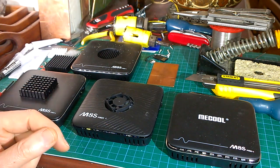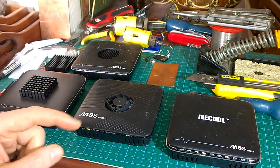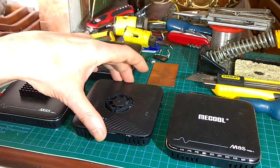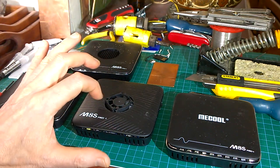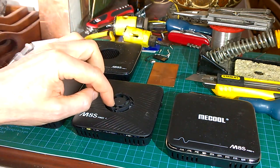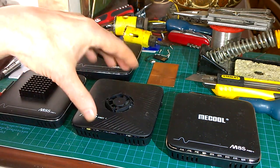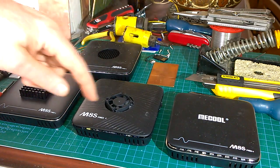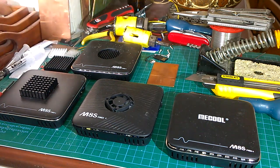I only need to use the fan when it's actually hot weather or when playing high-res 4K videos at high frame rates. This is an upgraded heatsink and a Pi fan in the box — it just lifts the lid slightly but the screws are long enough. You cut down with the craft knife right on the edge, to half the depth of the fan, leaving a lip at the bottom to hold it down, and when you screw it on it holds down the heatsink. You don't have to glue the heatsink — you can use MX2 paste, or HY910 glue or Arctic Silver Epoxy.